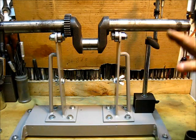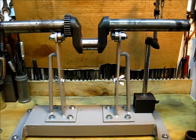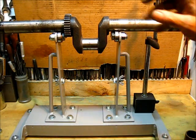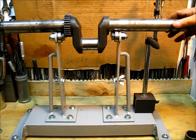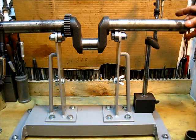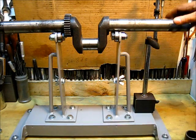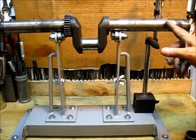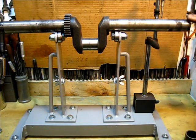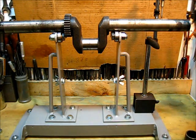When this machine is in use, I will have two dial indicators — one here and one on the other end — and I will compare the two. From this point out on each end, that was free material. Most of the time, almost every time, this part right here will be rusted and will have been emery-clothed or filed in order to get the flywheel off. The flywheel would be right in here and the bearing would be right here. So it's of no benefit to indicate this part out here — you want a true, non-worn surface.